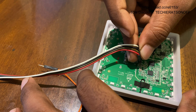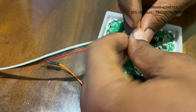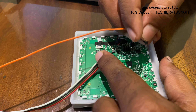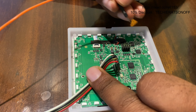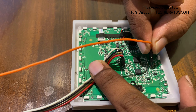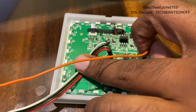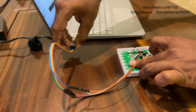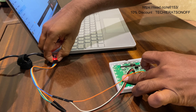Now we are ready to install the firmware. I am using jumper cables: RX to TX of the converter, TX to RX of the converter, 3V of the converter to the touch panel, and ground of the converter to the touch panel ground. I have also taken an additional ground wire to touch the boot pin (GPIO0) to ground, to put the device into programming mode. At the time of inserting, hold the ground and boot together; once inserted you can release the boot pin while keeping all four other pins in contact.